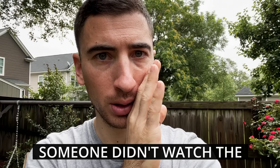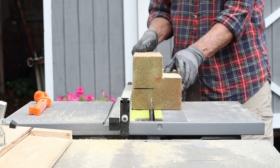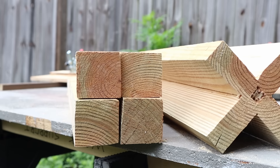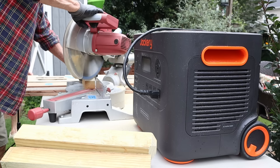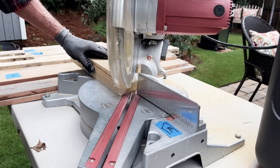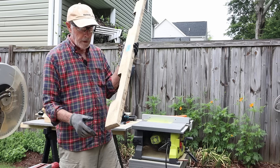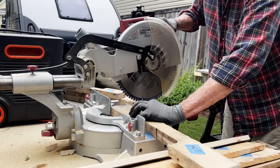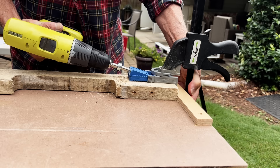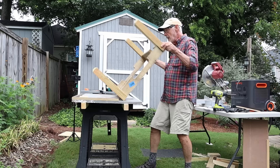Someone didn't watch the Don't Buy the Ryobi table saw video. One 2x2-inch leg done. You know, rabbets like to multiply — I started off with one and ended up with four. One of the keys to pallet wood, even the ritzy stuff, is to make it appear more artistic, so I'm cutting a chamfer on these legs. This is one of the runners from the pallet, and it has a kind of built-in decorative feature. All that's left is to cross-cut these to size, use them as apron pieces, and assemble it all together with pocket screws. And here we have a base of a coffee table.